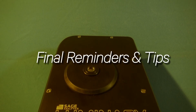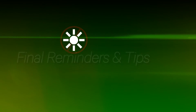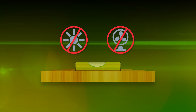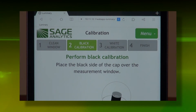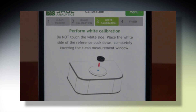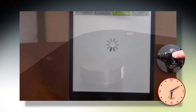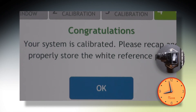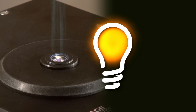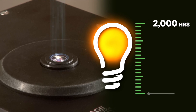Some final reminders and tips when using the Luminary Profiler. The Luminary Profiler should be stored in an area free of bright lights and strong airflow and placed on a flat and stable work surface. The daily calibration of the instrument will aid in ensuring maximum accuracy and will normalize the system. The calibration should be performed when the instrument is turned on and at least every 24 hours of continual use. It is acceptable to leave the Luminary Profiler on when not in use; however, it is equipped with a lamp that has a finite lifetime of approximately 2,000 hours. Therefore, when left on and not in use, the lamp's operational lifetime will be decreased. Replacement lamps are available from Sage Analytics.